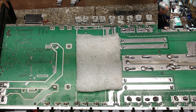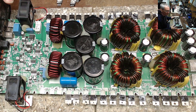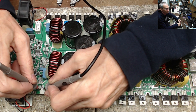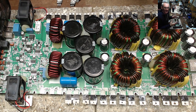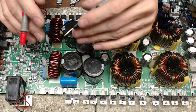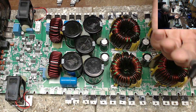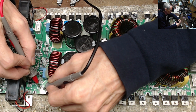Now the question is: was it one of the transistors? After removing them, look at that — 42k. So our drain-to-source short is gone. What I'm getting at is: don't get complacent in what you do on a daily basis, because you may overlook something as simple as a drain-to-source short that could potentially damage the work you just performed.